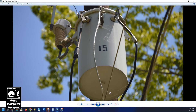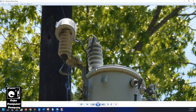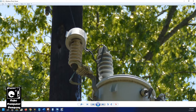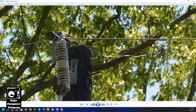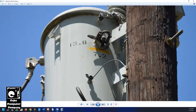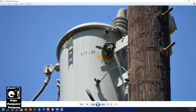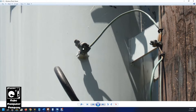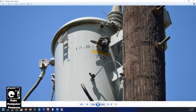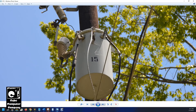These were taken with a DSLR camera. Up here is the primary bushing — you can see it's definitely larger because it's rated for a higher voltage. Over here is the lightning arrester, and up there is the fuse cutout with the fuse open. Here's the tap changer — it's set to 13.8, because that is the primary voltage, 13.8 kV or 13,800 volts. It warns you to de-energize the transformer before operating the switch. On this transformer you can see the pressure relief, the ground to the can, and the hoisting ears — one on each side.